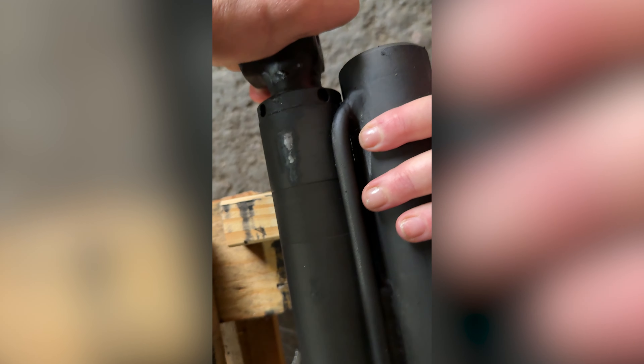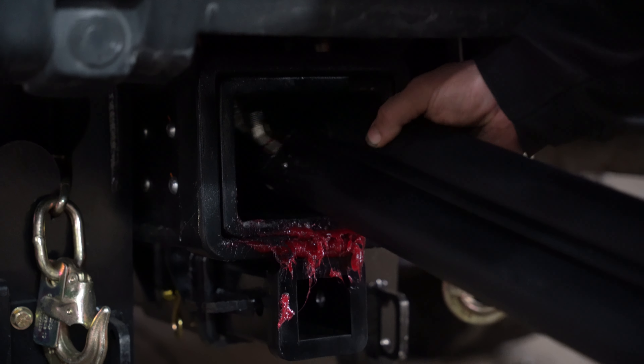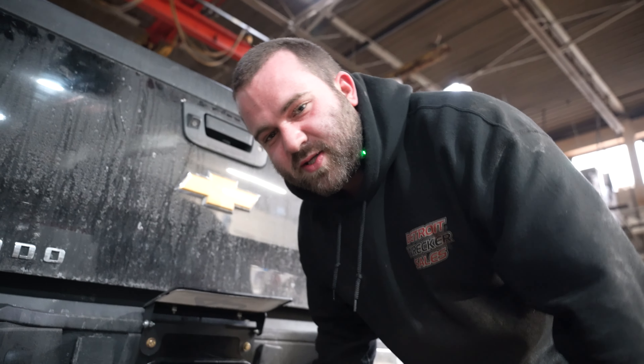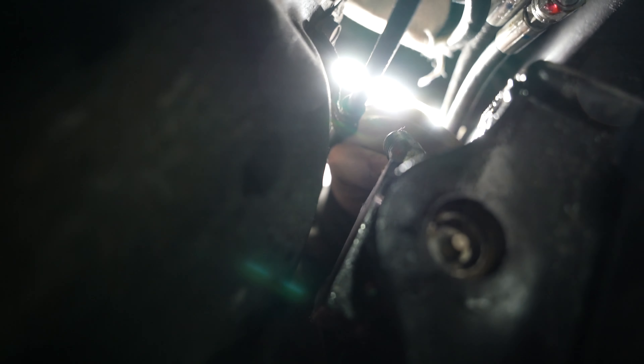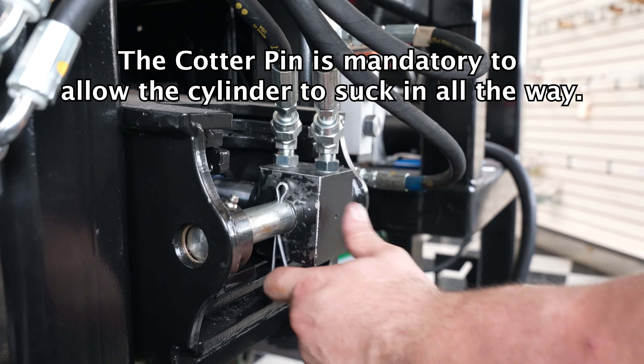This is right because it's on the inside of the barrel — it has clearance. This would be wrong because it's outside the barrel and it would hit, and it wouldn't allow it to go in all the way. Now we're going to go underneath and reattach the in and out lines and the rear stinger cylinder. First, I'm going to get the stinger pin in. Now that we've got the pin in, put the snap ring on on this side. I'm going to put the cotter pin right back through the hole — we've got the pin all the way in, now you just bend it.